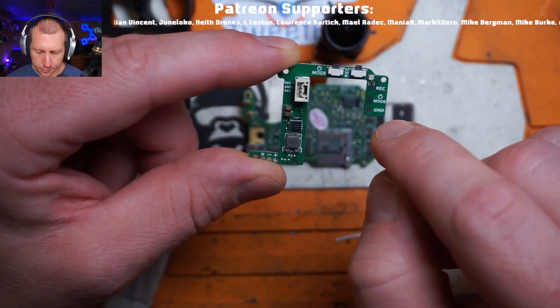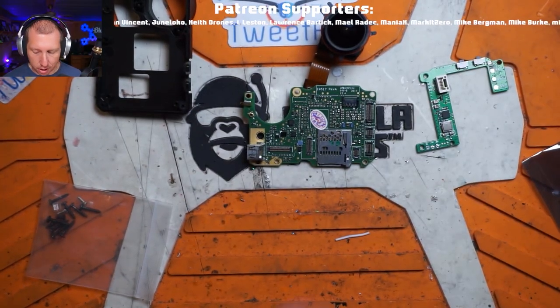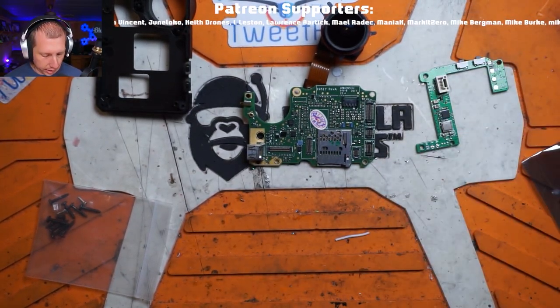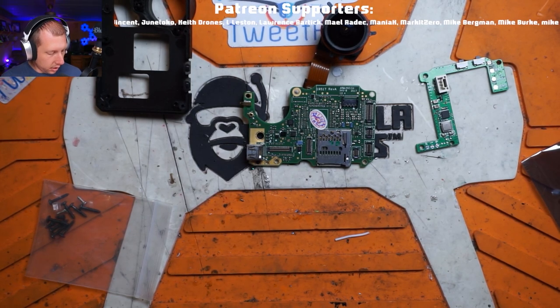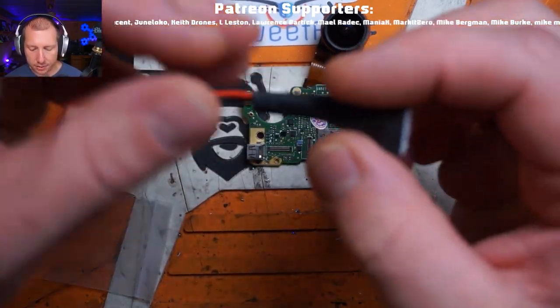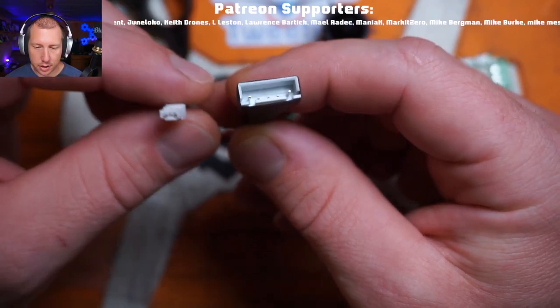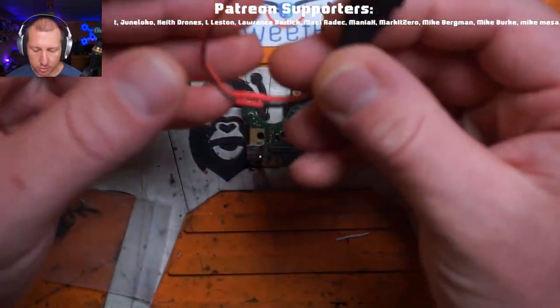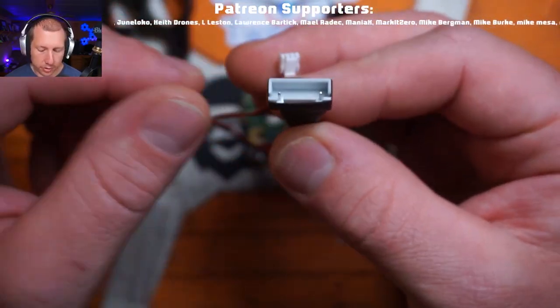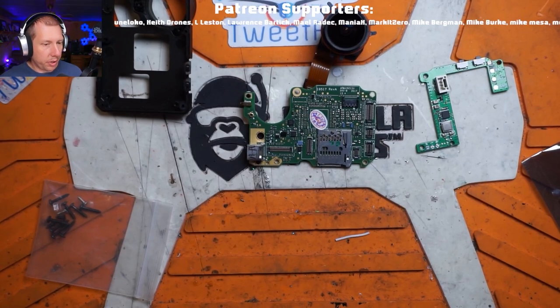So I never run the pin IO. All I do is solder a jumper from record to ground, so once you plug it in it'll power on and all you have to do is press the button and it'll start recording. I don't fly it on anything other than 4S - just take a 4S balance lead, pull the center pins out so you've got full pack voltage, and you can power this off of any 4S LiPo. So far that's been working pretty good for me.